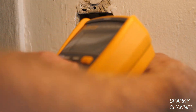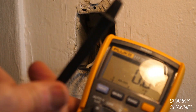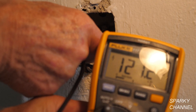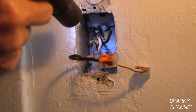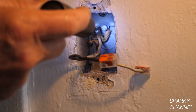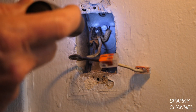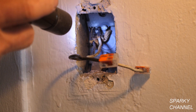Then I'm going to take the other lead and put it right to the back of the metal box — and I'm getting 121.1 volts AC. So this white wire is hot and the metal box provides a return path to ground, so when you put your leads across them you get about 120 volts AC. What I'm going to do is run a pigtail from this box and connect it to the metal box, and that will be my ground for my new switch.